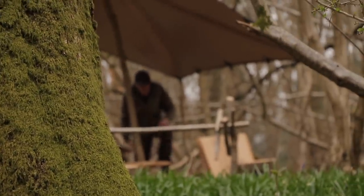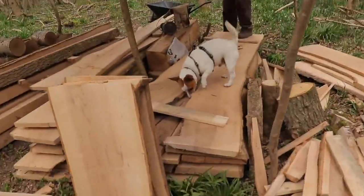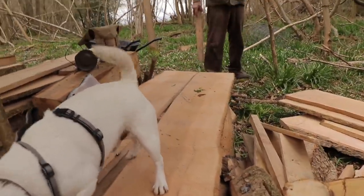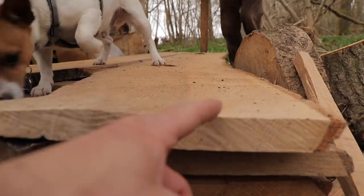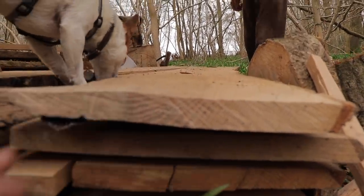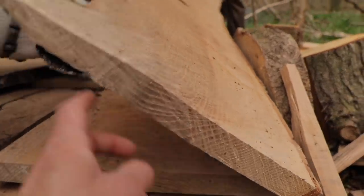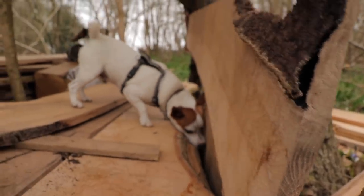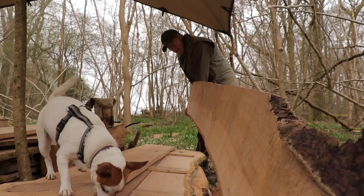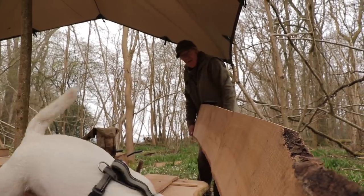There goes the piece. We're going to get through these boards, aren't we, Dad? Yeah. We are going to get through these. But how dry are they? And also, Ryan was really impressed with this, Dad. They've barely cupped at all. In terms of when they've dried, there's barely any bowing in them at all, which Ryan said he was quite impressed with. So I did something right. Maybe putting the PVA on the ends, because that's all sealed with PVA glue. Yeah, maybe that really helped. And also putting them under the tarp, possibly the time of year that we did it, winter. So there's no sunlight that's going to keep drying it out and burning it.